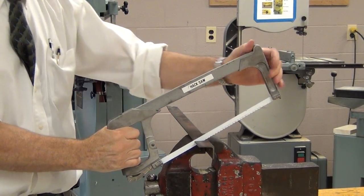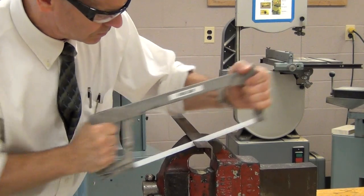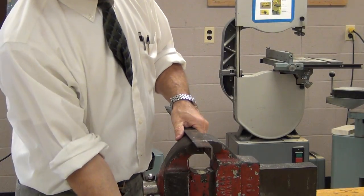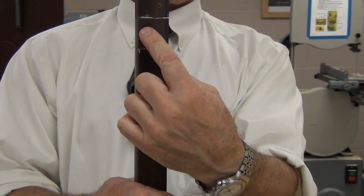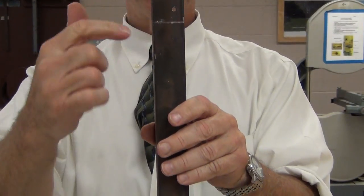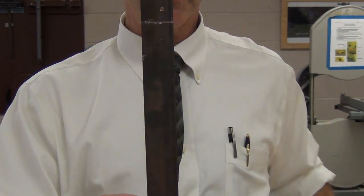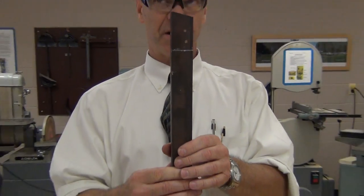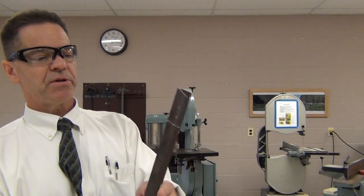You should be able to see that it's actually starting to cut well into the metal. I have cut all the way through this side of the angle iron — you can see a nice gap there in between. The hacksaw did a really nice job with a reasonable amount of effort to cut that steel. That's partly because of the shape of the blade, but also largely because the blade is a hardened steel and this is not — this is mild steel. It has not been hardened, and this type of steel really can't effectively be heat treated because it doesn't have enough carbon in it.